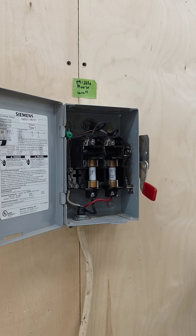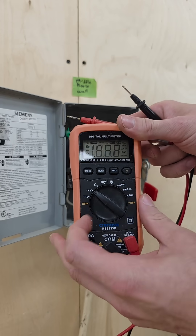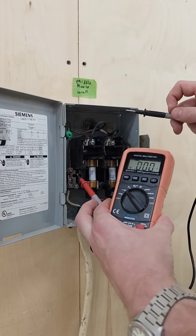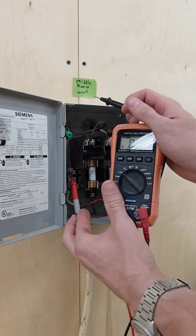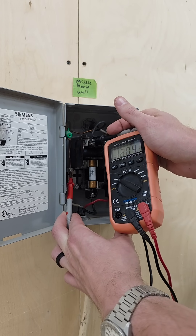Now like I said the power is flowing, but I like to start that way because I want to test and get a confirmed positive that it's on. So I turn to the little V squiggle on my multimeter for alternating current and I'm going to use one probe on the neutral and the other probe on the power in. I can see I'm getting a 120 reading there.